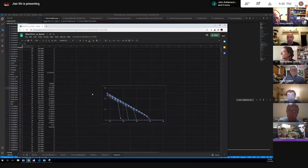Or the voltage. Are you giving the proper voltage to the motors? Yeah, I'm using this block battery, a 12 volt battery. I didn't measure it, but I can measure it. When you say a block battery, all you have to do is put your voltmeter across the battery leads and see if it sags. Oh, that should be plenty. It's just little Pololu motors, right? Like 25 millimeter motors.